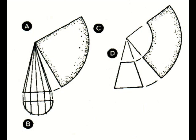Draw a semicircle below the side view, drawn in scale to the size you wish for the finished megaphone. Divide its edge into any number of equal parts, such as 6, figure 611b. Set dividers to the width of a part and step this off around the developed bottom line 12 times to represent a full circle. This gives a very close approximation to the developed length around the circumference, figure 611c. In effect, the dividers are stepping off chords across a small circle on a larger one.